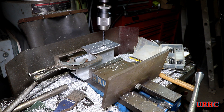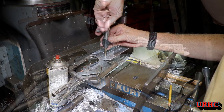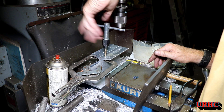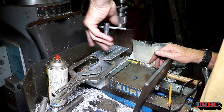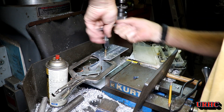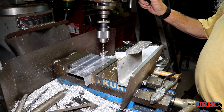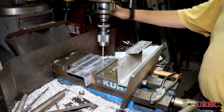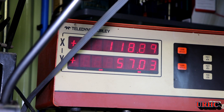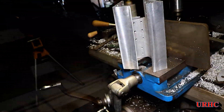The DRO on the machine makes it easy to watch what you're cranking in. This is all metric because the table is metric, so the DRO really makes everything easier — it could all be done by hand but that's the hard way. Then going back and tapping everything — I kind of hate tapping aluminum because it's so soft, but you have to do it. I also need holes in the side for mounting the bracket to the bearing block, so I'm drilling those a half millimeter oversize. You can see the DRO is great for finding your location and you can switch back and forth from inch to metric.